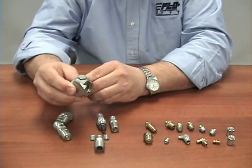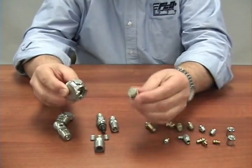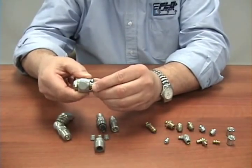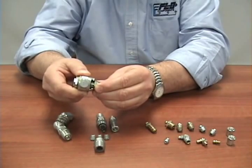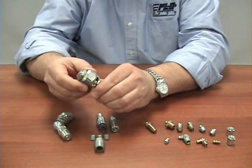This is the actual button head coupler or adapter we talked about for electrical motors. When you take the button head fitting, this coupler slides right on top of the fitting and you can now dispense lubricant. One last thing to note: when attaching the couplers to the grease fittings, you should always wipe both the fitting and the coupler, thereby eliminating the possibility of pumping contaminants into your bearing points.